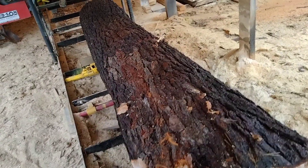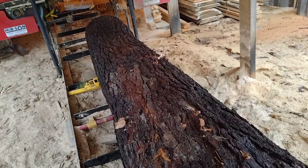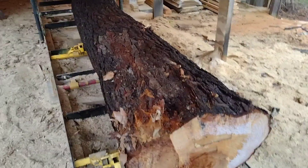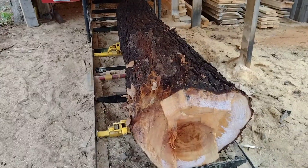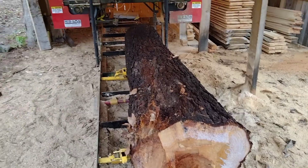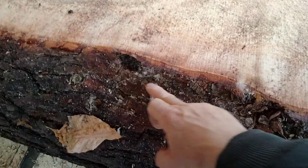What we'll do is take these flitches and put them over here, then get the heart box out and get it off the mill. Then we'll start cutting the flitches to get them into one and a half by eights. It's kind of a long drawn-out process to do it this way, but when you have a log that has blemishes like this rot, sometimes you have to do that — open up the face. I'm kind of worried about this little blemish right here, but so far it looks pretty good.